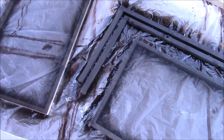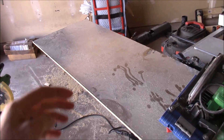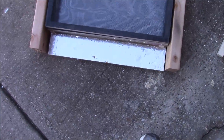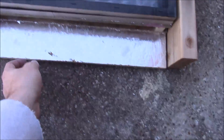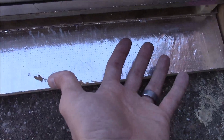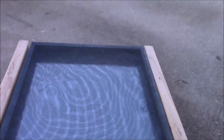Now it's time to actually build the frame of the box itself. I've got a piece of solar board left over from my shed project — it has basically an aluminum foil glued to one side, otherwise it's just normal particle board. In every video it's become a tradition that I make a small mistake — I forgot to leave a little bit of extra length on the bottom so that we could have a plenum at the bottom, where cold air will come through this channel and collect at the bottom before being sucked up through the screens to the top of the device.